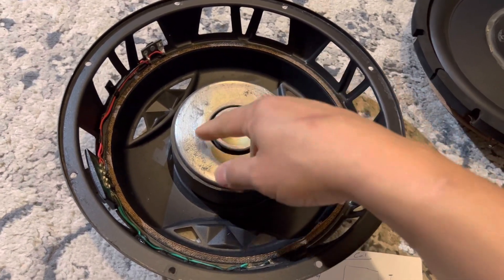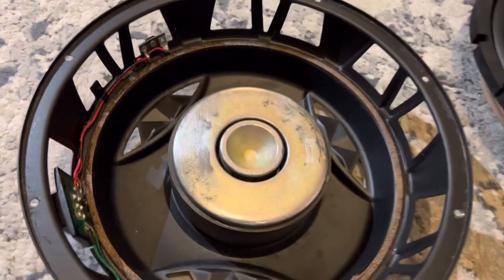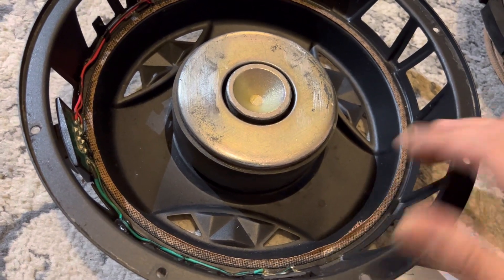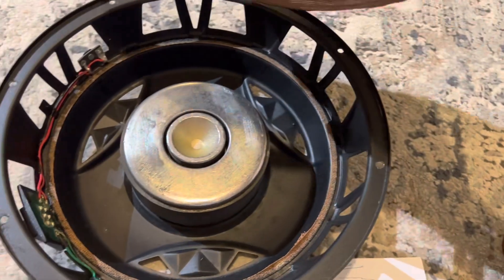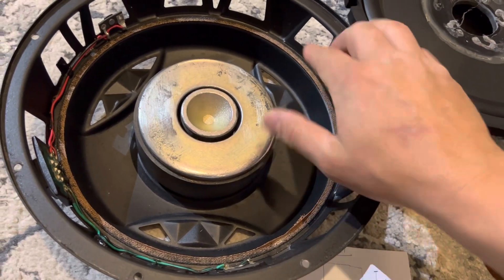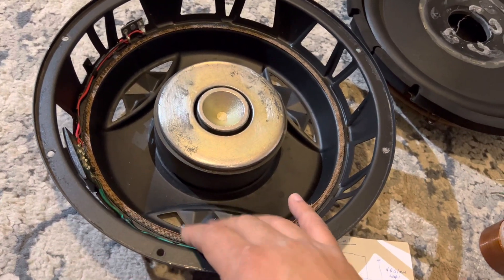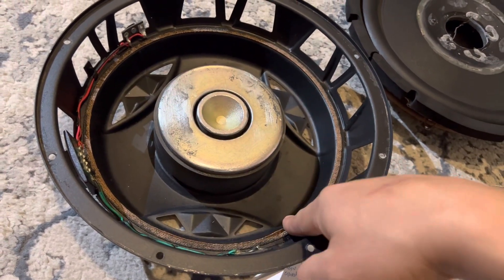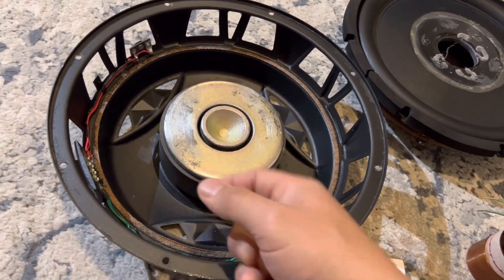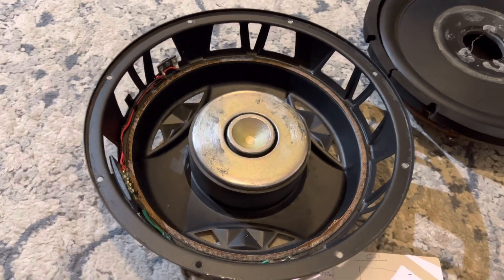Before doing anything with the install, I'll use the air compressor to make sure there are no foreign objects or debris in there - clean it all out with Q-tips, make sure everything is prepped, nice and clean, and ready to go. When I add the spider back, I'll add black RTV all throughout the mounting area and on the outer edge as well, carefully place it, then work my way under the basket to ensure a good bond. Even if it's only 70-80% bonded, let it dry and come back with more beads to hold it in place. The spider only has so much travel, so this should be straightforward.